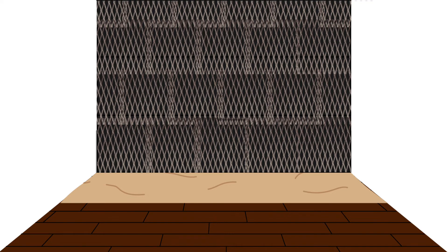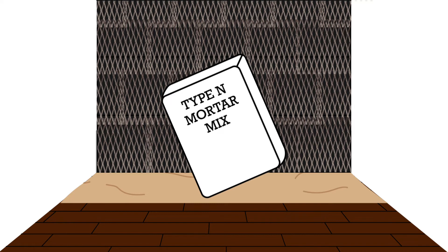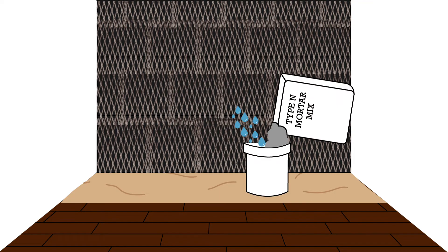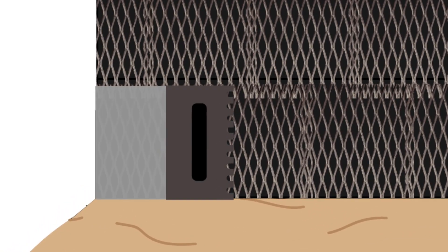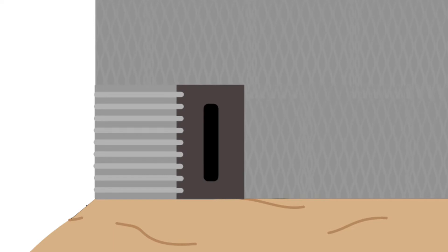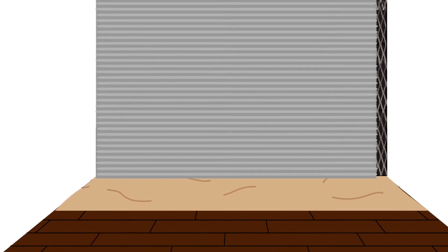After completing installation of the WRB and metal lath to your wall, you can start laying down the scratch coat. This is a coat of mortar that will help your Kony Brick better adhere to your wall. We're going to be using Type N mortar for this installation as it's the best choice for general application. However, you can also use Type S or thinset if you desire. Mix the mortar with room temperature water and apply to the lath, using the flat side of a trowel to smooth it out. Apply a second, generous layer of mortar. Comb the mortar with the ridged side of the trowel in straight, horizontal lines along the wall. Repeat this until the entire wall is covered.